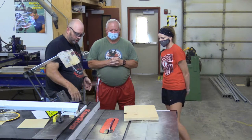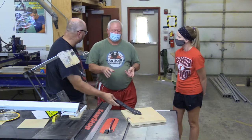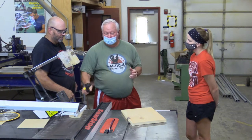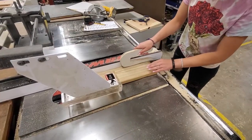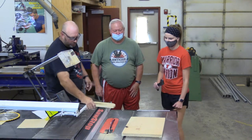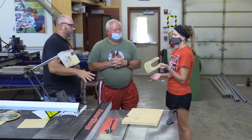What happens when you get too close — like a cut like this? That's where the manufacturer sends these handy dandy little things called a push stick. What's your opinion? Honestly, I would never use that cheap one. I've got a better one at the woodworking shop. I'm an intermediate woodworker, not an expert, but I have these at my own home shop. You get much more control over the board and personally I just feel safer with them. Here, just try to push the board forward. And what if I lift it? Do you have any way to stop it? No. Okay, let's try that again with the push stick — see, I'm actually lifting harder than I did the first time. So why wouldn't you just use it all the time?